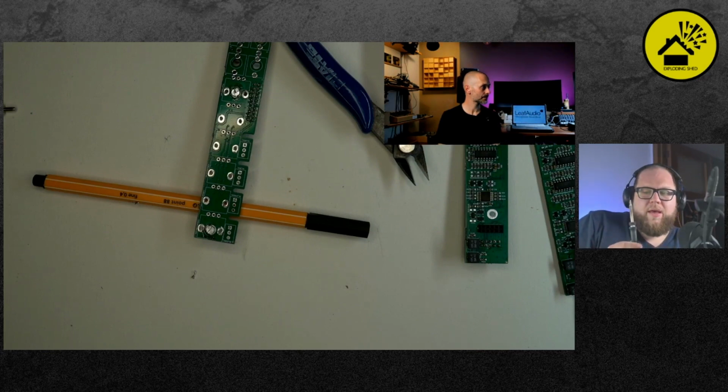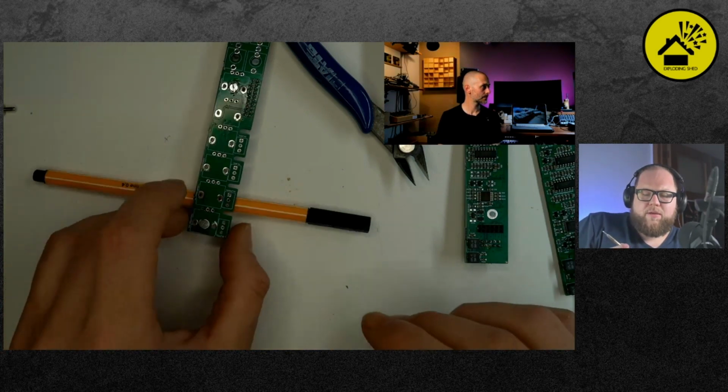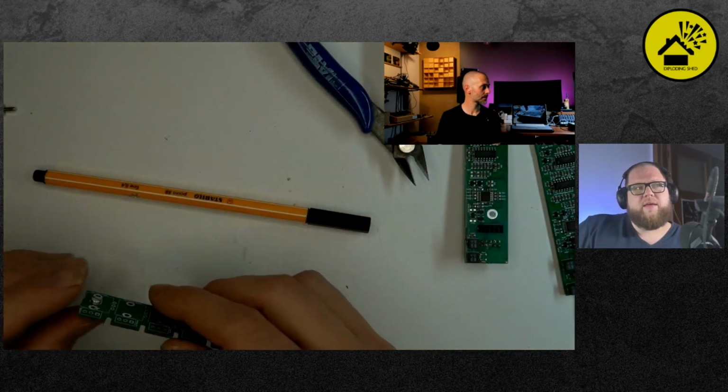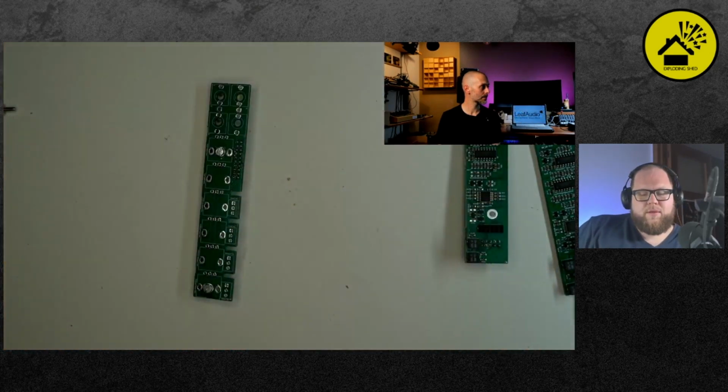Yeah. And that really makes a lot of difference, because I only replaced this guy a little bit over a year ago, I think. And now that I have an active tip system, I usually solder lead-free at 325 degrees, and that works like a charm. Yeah. But that's just because the temperature gradient isn't there. And so if you put this guy at 350, chances are that at the tip it's 325. And so it's all relative.